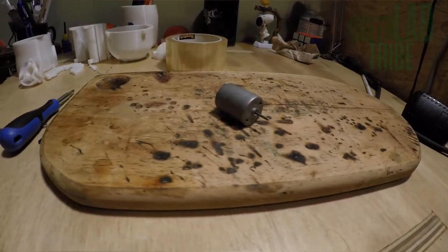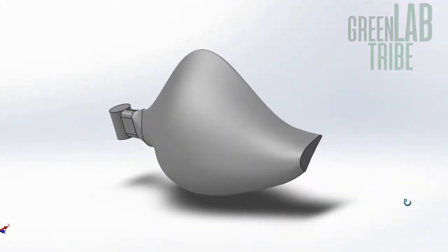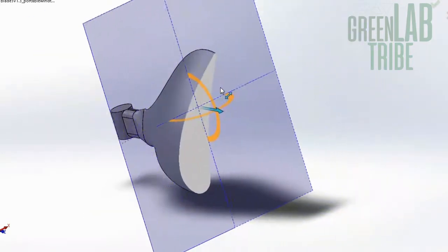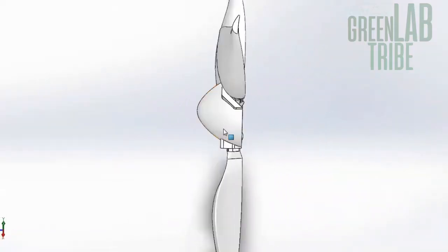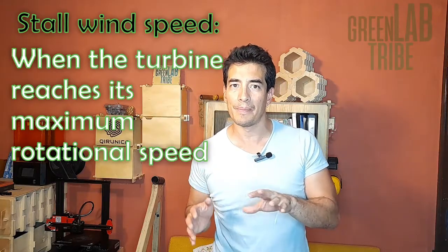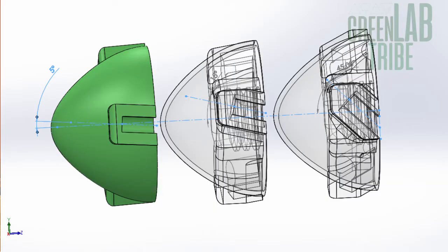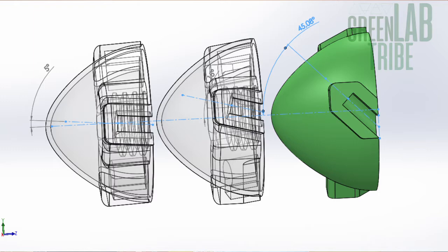Following the rule of making it small, I used this small generator that is easy to find and gives the necessary voltage to charge the batteries. I used the regular blade shape and defined its parameters according to the needs. I chose the blade's size and airfoil for a theoretical power output of 21W, and from this base I made some tests to adjust configurations like the angle of attack, the cut-in wind speed, and the stall wind speed. The stall wind speed is where the turbine reaches its maximum turning speed — this can be used as a safety feature. With a small angle of attack, the turbine will stall at low speeds and never reach charging voltage. Too high, and it will only generate power at high speeds and might turn too fast and be destroyed.